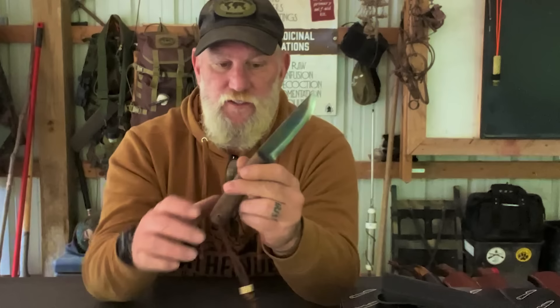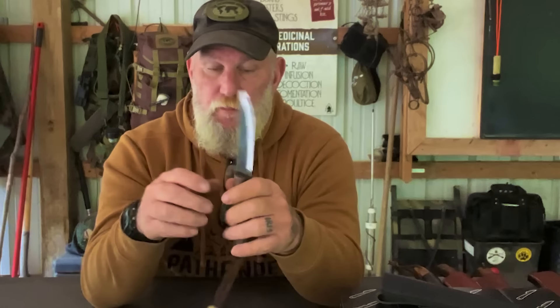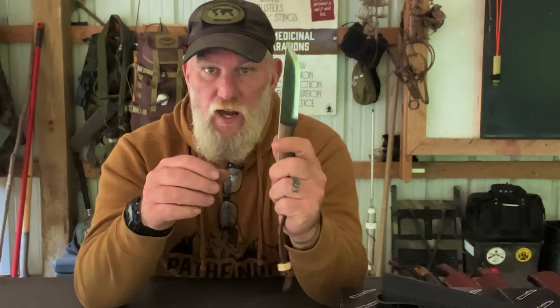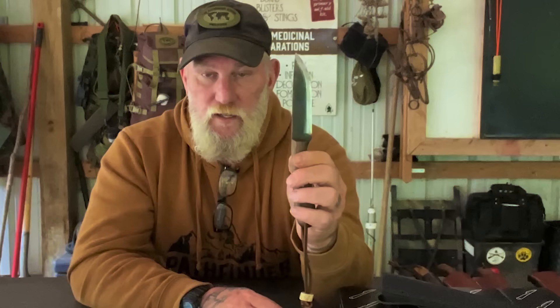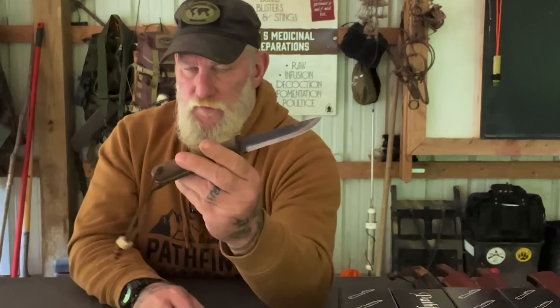The Scorpion is about four and a quarter to four and a half inches, with a Scandinavian grind to zero — stays sharp for a good period of time and sharpens easily in the field. It is 1095 high carbon steel, and even Ethan Becker would tell you 1095 is the best knife steel because it's simple and repeatable. Making a hundred knives exactly the same by hand in a small shop is very difficult without jigs and training — that's what we try to do at the Pathfinder Knife Shop.